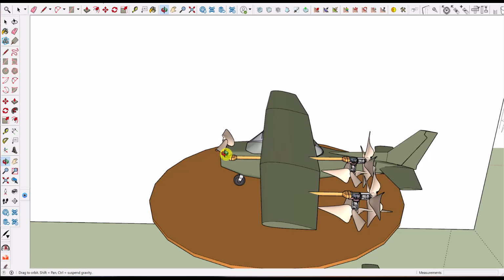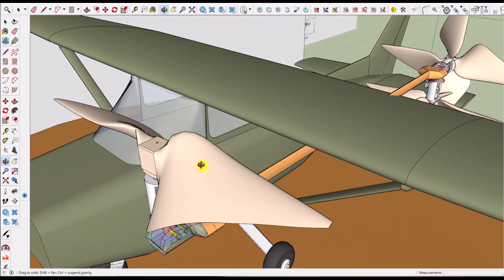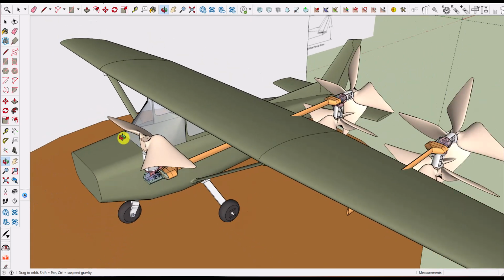The motor needs to be the F11-14 motor. What you do is you take the F11 motor, the Parker-Hannifin saw motor. It's used for sawing wood, so it's a very high RPM motor, but it's not very big. And so you can connect that high RPM saw motor to a Framo Morat GSB-120 speed reducer and cut the RPM of the motor by 4-to-1. That combination is less heavy than just getting a Parker-Hannifin motor. And you only need 1600 RPM in these propellers to get this plane to go vertically straight up.